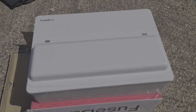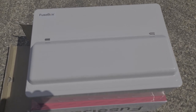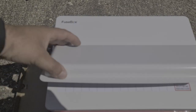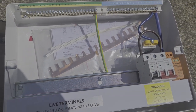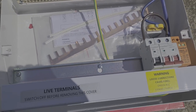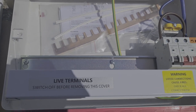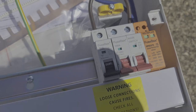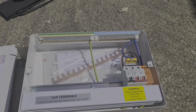I've just shut the door on Matthew because he's making far too much noise actually working. We're going for a Fusebox board on this one and I've never used one before so it's a new one on me. Seeing loads of people using them across social media so I thought we'd give it a go. One of the things I like straight out of the box is it's quite weighty - a good sign that it's solid, good quality metal. Even the front cover has a weight to it, it's not cheap and flimsy. It's all cast in one solid box, which I like rather than the pressed corners you get on some other consumer units. There's a nice grommet strip in there, a nice tails clamp included, and a single module SPD - though it does need its own MCB.